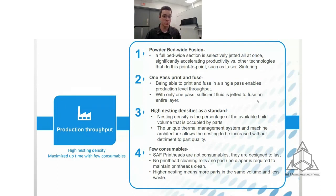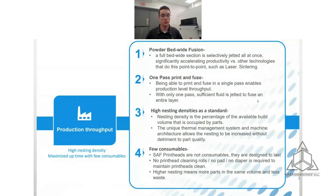The printheads in this machine are not a consumable — they're industrial grade, built to last, and if anything happens to them they're replaced as part of the service contract. Since this machine operates unidirectionally and linearly — the sleds always moving in the same direction — that provides a lot of thermal consistency. One of the challenges with other powder bed fusion machines is that one spot in the build could have a totally different thermal experience than another spot. With this machine, they've eliminated that because the two sleds move in the same direction the entire time, producing really consistent results.